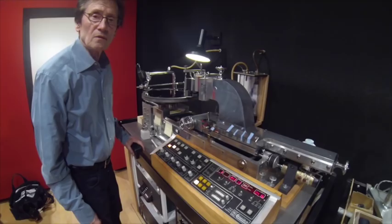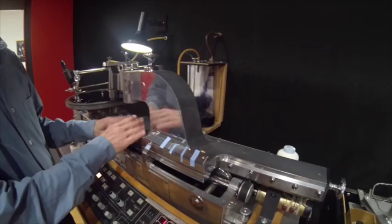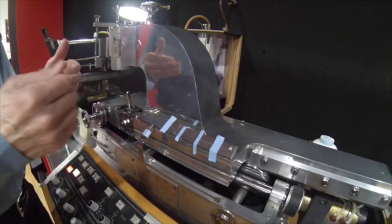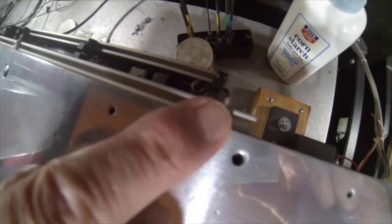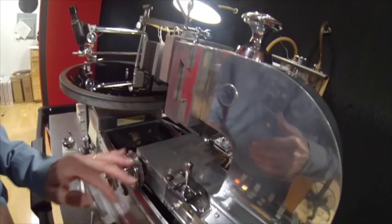The lathe gets started and tells the tape machine when to start. It's a pretty basic, very simple way that it does it. Because this thing is moving, when we engage it, we have to engage this into what we call the lead screw. When we engage this and put the lathe on lead-in, the way it can tell when it's at the right spot is something we determined. We've added these little photocells to the lathe back here, and there are little wire pieces of metal that go through the photocell. When it hits the photocell, it sends a signal to the computer that says drop the head. Then the head drops and it goes into lead-in.